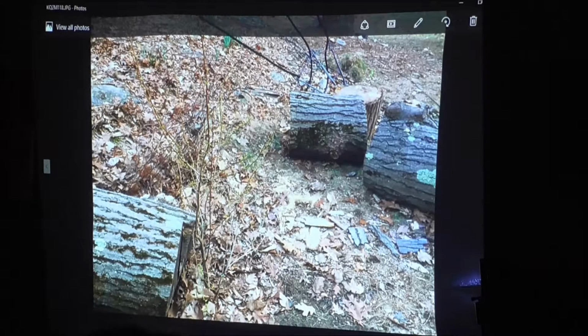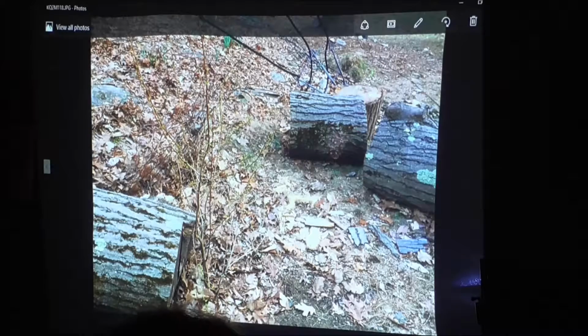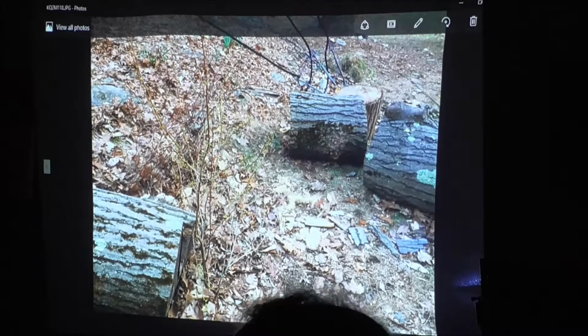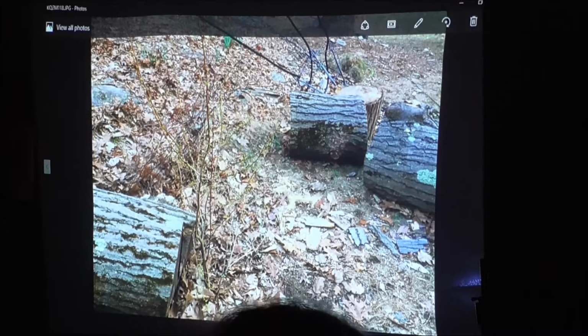It is a thimble. Years ago, when I was helping KQ2M build the station around 1989, 1990, he was one of the first to use the quarter-inch preforms. They were new. The previous way of putting up guy wires and holding them in fast was you use the little saddle clamps, and then you tighten the nuts at 3 different points, which was a nice way of doing it, and it worked.